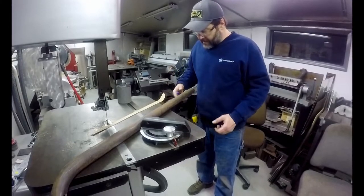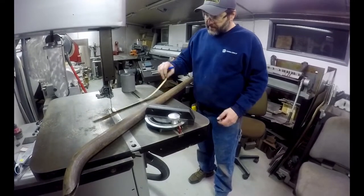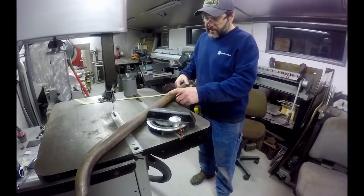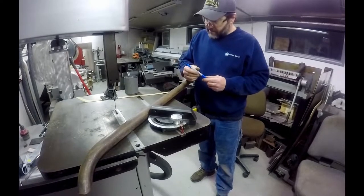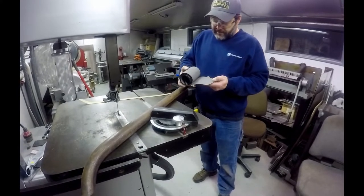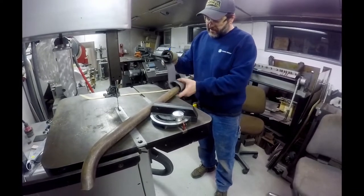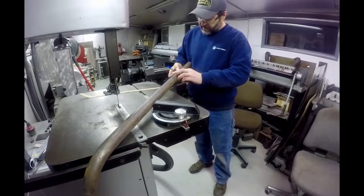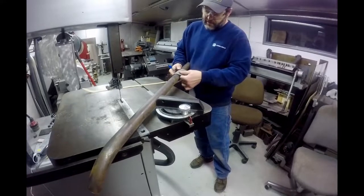We're gonna do a little bit of cutting. Got some old piece of tubing from something else that we had used at one time or another. I wanna just show you a quick little way. You wanna cut a nice straight line all the way around this to make it cut off square. They sell something like this for doing pipe work. It's called a pipe wrap. And now you wrap this thing around it until your edges line up. And once your edges all line up, you know that piece is on there square.